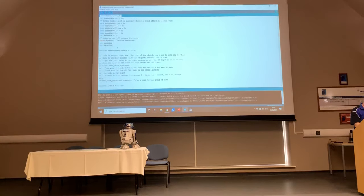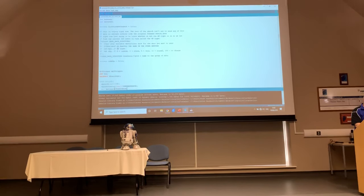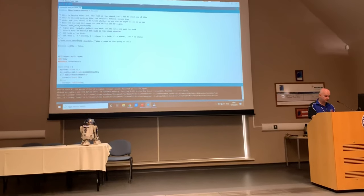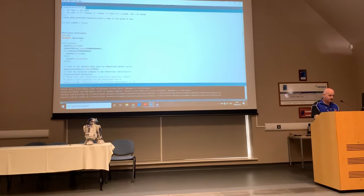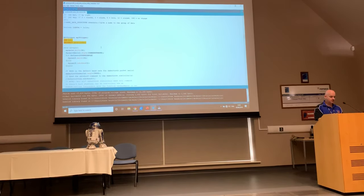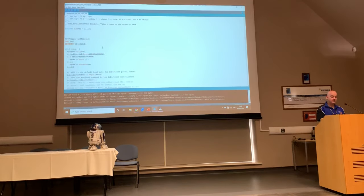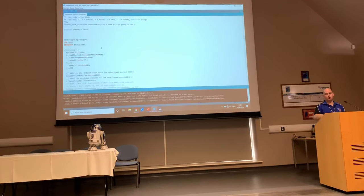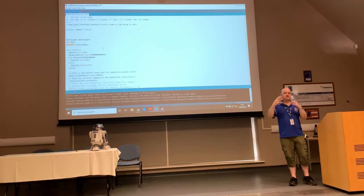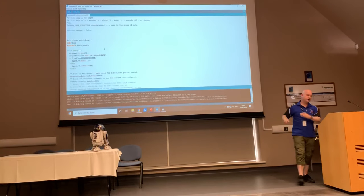Okay, so on mine, I've got some stuff about telling you whether my servo's on or off, which is quite important because you don't want your gas canister suddenly emptying itself when you turn the droid on. And then what we do is we say, okay, let's go and start talking to our Xbox receiver over USB. Again, if you're unfamiliar with Arduino stuff, all we've done there is tell the Arduino, this is stuff you need to know about, okay? Just stick that in your memory and keep it there.